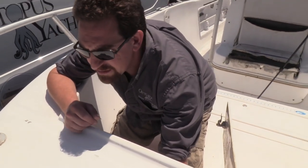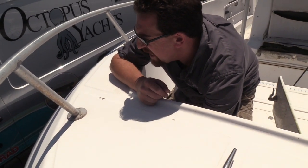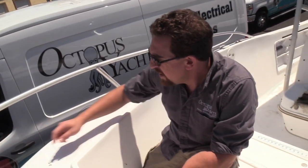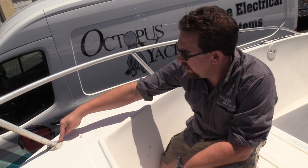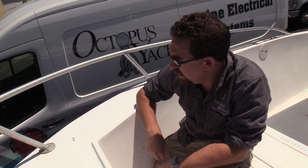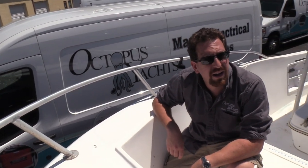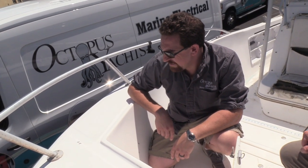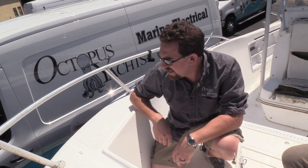You can feel under here — the cleat is through-bolted, but the bow rail itself doesn't seem to have hardware going through, so it should be as simple as unscrewing it. We may run into some corrosion between the stainless steel and aluminum. Afterwards we can make nice little circles out of marine starboard, put hardware in place of the screws, or refer to a fiberglass guy who might match the non-skid. Given the nicks in the fiberglass already, the simplest option might be putting in new hardware — we'll see once we pull the bow rail off.